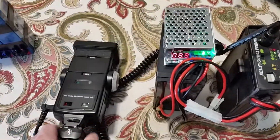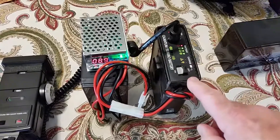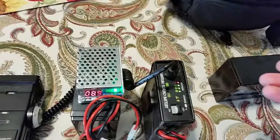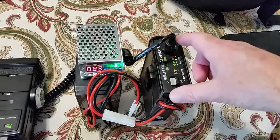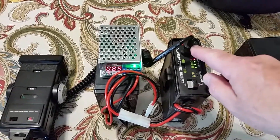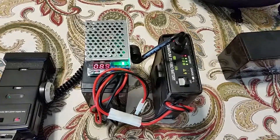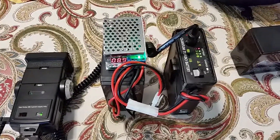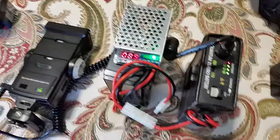A very powerful setup with a flash that takes a lot of energy to recharge. This is a classic power unit that's been around for a long time — they no longer make this one; they're now on the third generation. But this old style is very well built. This module comes out of the case with all the electronics. It was originally designed to have a 12-volt charger plug in place of the flash cable to charge it, and then you run your flash cable separately.